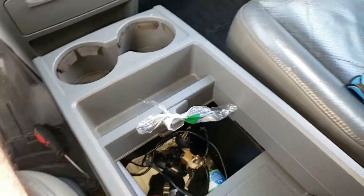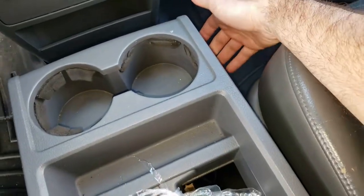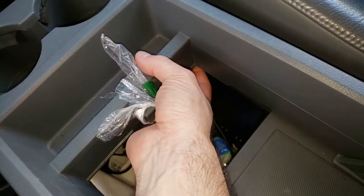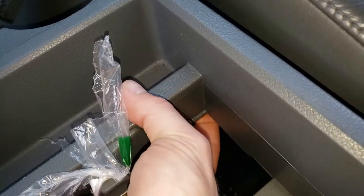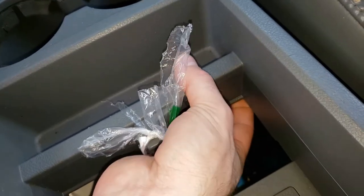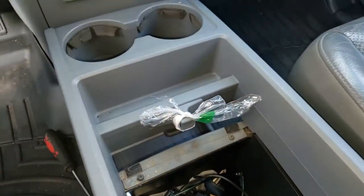I found a trick. Instead of struggling to go underneath the drawer and get screwdrivers to pry those pins up, you can just put your hand right underneath here and you'll feel that spring-loaded pin. Put your finger right in the corner and press upwards — you'll feel it. Do that with both fingers, one on each side, and then just push the drawer straight forward and it'll come right off. Push the pins up — boom — all the way forward.